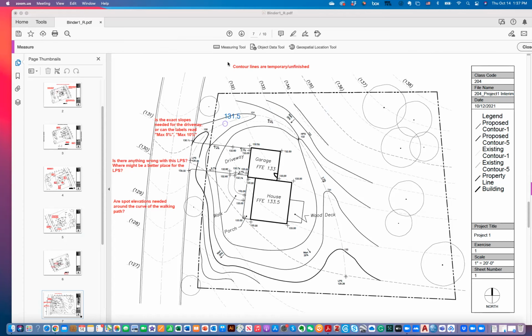And the length here, I think this length, I would think it's about 100 feet. If it's 100 feet, then you have to rise to at least 133.5 to make it work. Does that make sense? If it's around 100 feet for that center line part, because 2% of 100 feet would be 2 feet in elevation difference, right? So your HPS needs to rise to about 133.5, meaning that here you would need to be at 134. Even a little bit more than that, because the distance seems to be longer than 25 feet there.